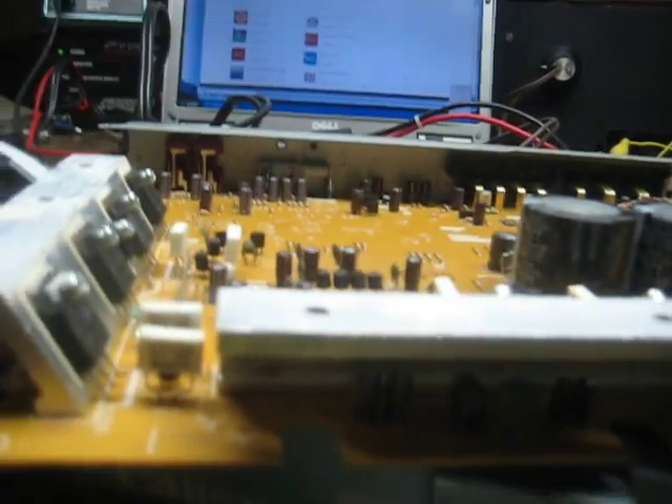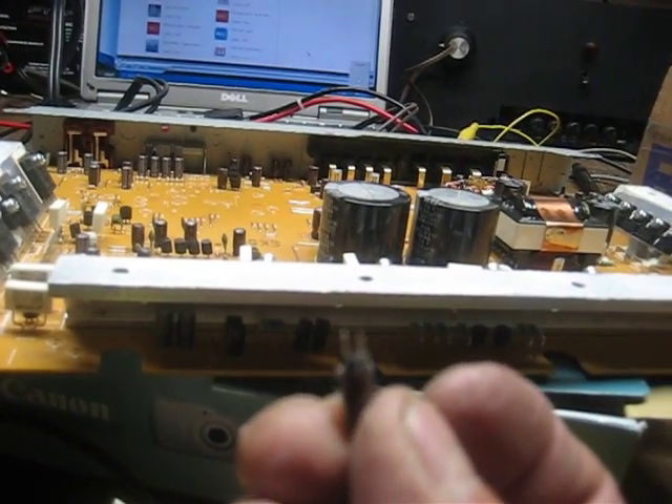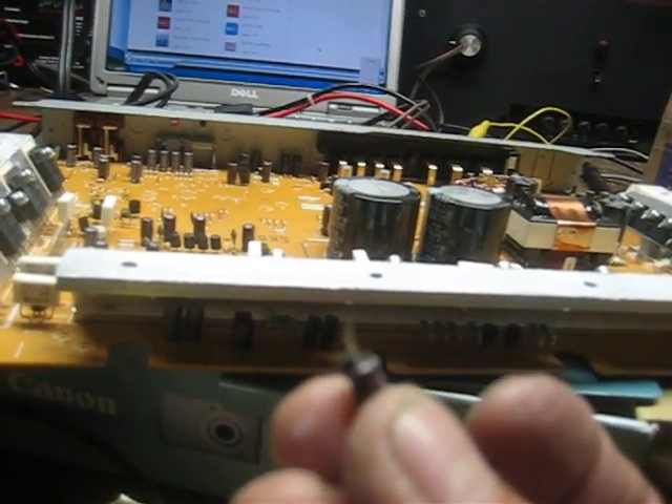You can see under here what we did — we got a couple of diodes in a string right off the edge of the board and we bypassed it. We had also blown up the two electrolytics. You can see they're all swollen with rubber plugs coming out the bottom.